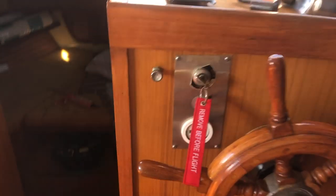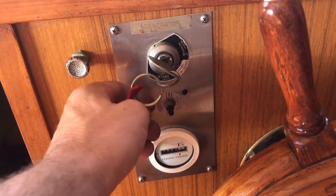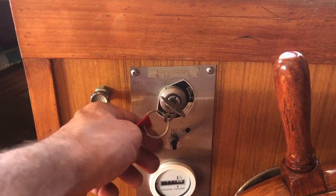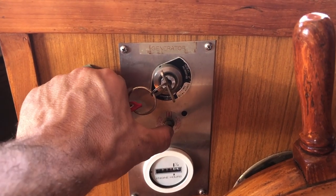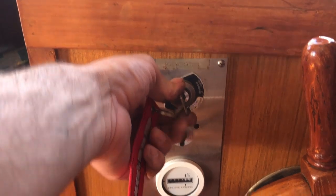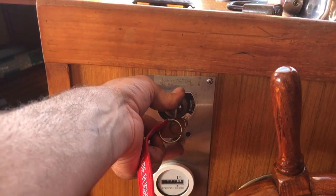I got the safety wires reconnected for oil pressure — low oil pressure. That's what this push button is for. When you're starting the engine before you have oil pressure, the way the system's designed, you have to hold this cutout switch until the engine turns over. I had that bypassed since the gauge was bad, so I've reconnected it. When I turn the key on, I can hear the click — it's working. If I crank without holding the button down, because there's low oil pressure, the engine won't start. If I hold the button in and turn the key, the engine will turn over.